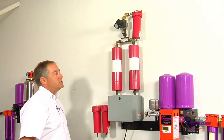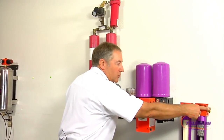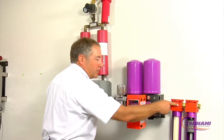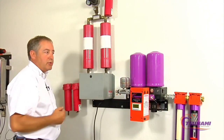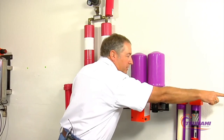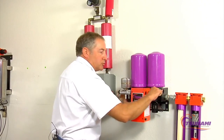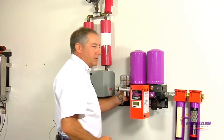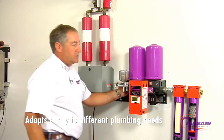Some of the main differences in designs are the plumbing. We come in in one direction here — we have an inlet, we come in, we come through the dryer, we come out the outlet and keep going in a straight direction. If you need to replumb it and go in that same direction, you can still very easily do the plumbing and piping from this direction, coming out one of these outlet ports. You can go right out the same direction, or put an elbow and go up or down as needed. So it's very, very easy to plumb.